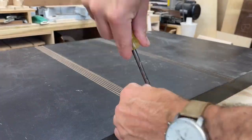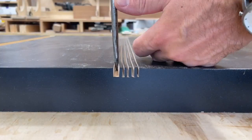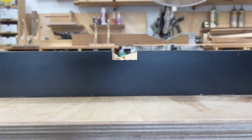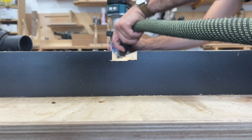This top is a composite top so I think it's MDF underneath with an HPL or some sort of coating. You can see here with all those kerfs I just have to knock that stuff out and then I'm going to use a template bit to clean up the bottom of the hole.